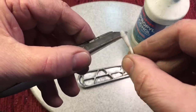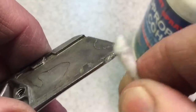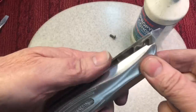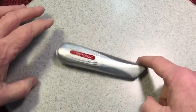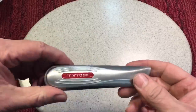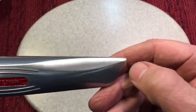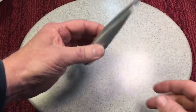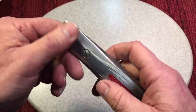We have a Q-tip with alcohol and we're cleaning that chip — we want to make sure there's no debris inside. We've got to prep it using 91% alcohol or denatured alcohol. You can see it's cleaning it out nicely. We put a piece of tape over the other side, put the two halves together so the JB Weld won't stick to that half, and we could fill it. Now, my favorite part — remember what it looked like before we started? We're calling this project done. You can see the repair there; we did a pretty decent job. It's very hard to see — it's a nice little repair, painted silver. I think it blends in pretty good; it's something you wouldn't notice right away when you looked at the knife. I'd consider that a successful repair.